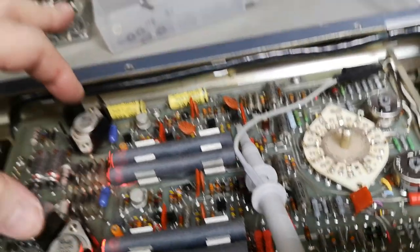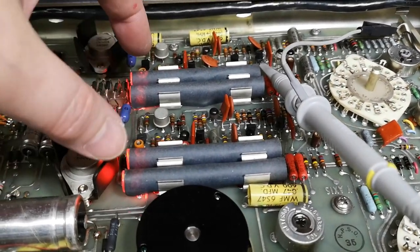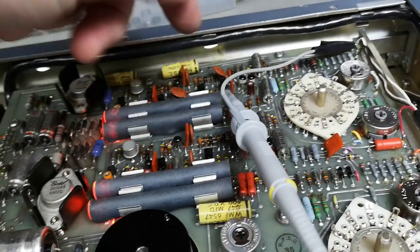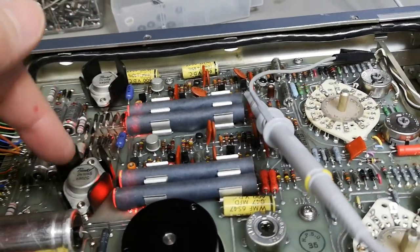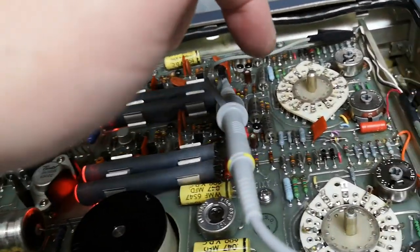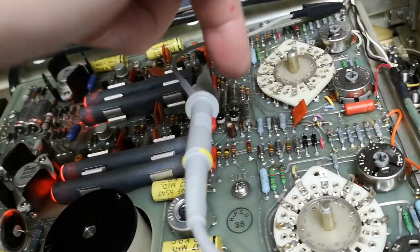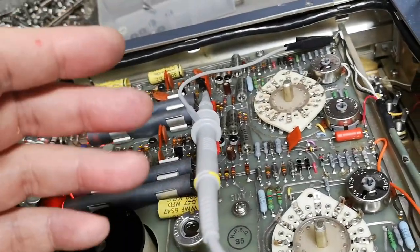That is weird, right? But this is exactly why when you turn on the light signal, that is also the drive signal that initiates all the signals to the field effect transistors, then it goes crazy and then the motors just run bang all the way to the end. And you also see the other motors moving slowly without light, and that's of course because there's a leak in the field effect transistor system. And then when you get some light, and then smack, a lot of signal, and the other one is not working, there's no balance, so the motor's just running all the way around.